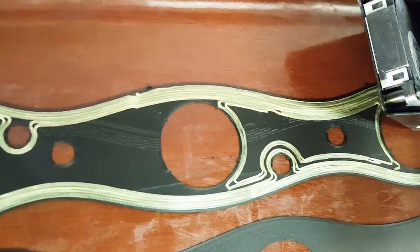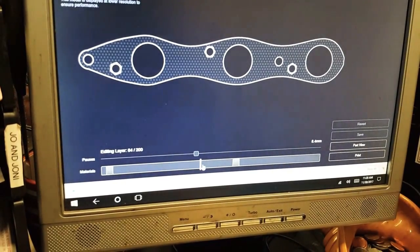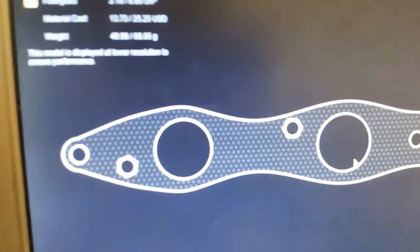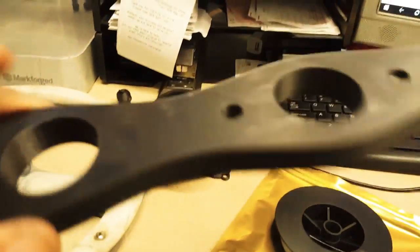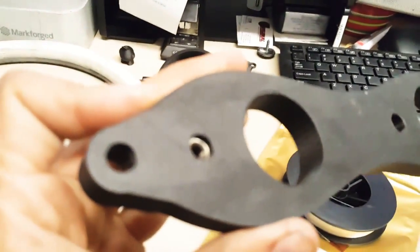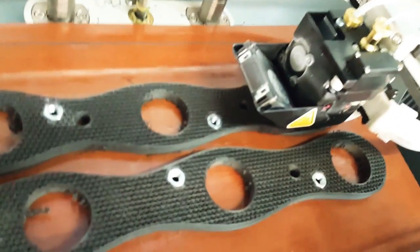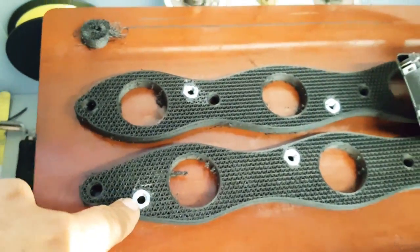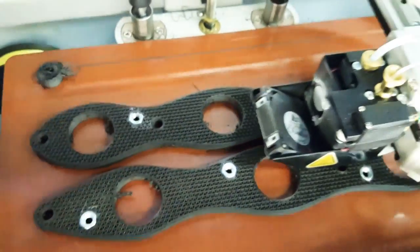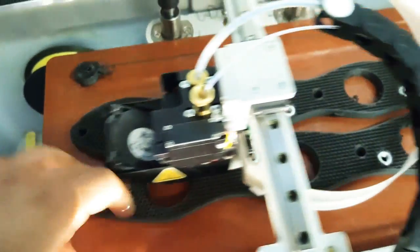Here's a close view. If you pay attention, it looks like there's a nut in there — because what I do is embed a metal nut right there. This is the part where I pause the machine and take the chance to insert the nuts into the part. So when you screw in the coil pack, you're screwing into a metal part, not into the carbon.